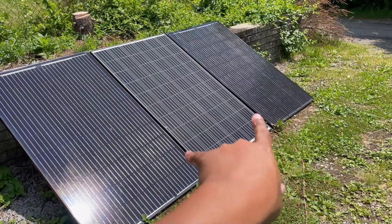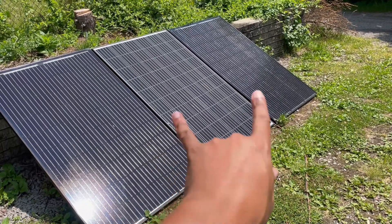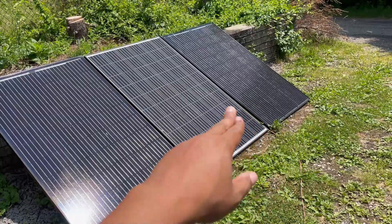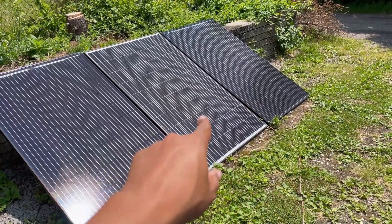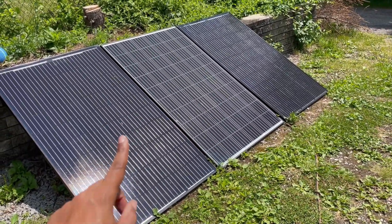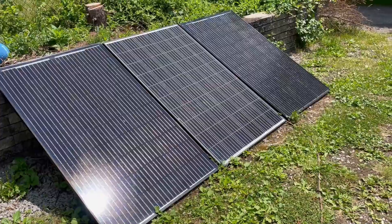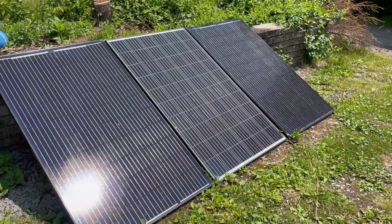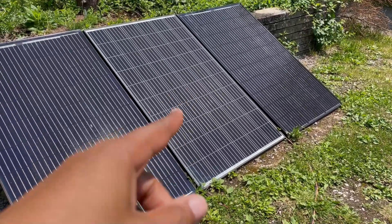So the only option I have is to take these amps and combine them in parallel, and I think I'm ready. What's going to ease my mind is knowing how many amps are coming off of these panels on a nice, super bright day — and we happen to have a somewhat nice, super bright day. A little haze over the sun, but let's do some measurements.